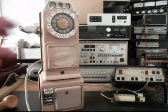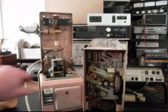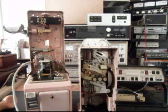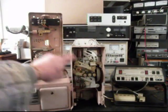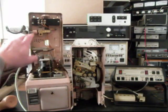A few more issues that we have with this telephone: since the body is loose from the unit, there are no contacts. If you notice here, there's usually a leaf contact strip that runs up and down this telephone. In order to save Gene money, we're going to use a different type of connection. We'll probably use some type of line cord to shoot over and plug into a modular port to the base, and that will make our contact between the body and the base.